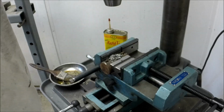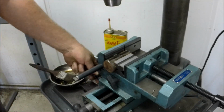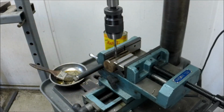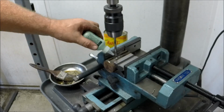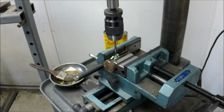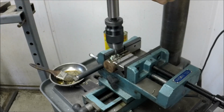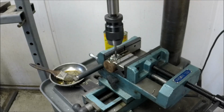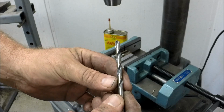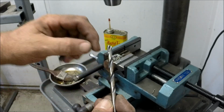Okay. Let's give the other one the same punishment. Just gonna back this up a little here. Take drill bit number 2. And we're going to do the same thing here. Just going to give it a little spot. Come in here and put a little bit of my, I finally cut a hole in my thing in my tip there. Ooh, well, I got a lot of that stuff on there. Okay, well, we'll give it the benefit of the doubt. A little smoky. Still clearing a chip. Still diving good. I don't feel anything binding up. Just diving down good. And there, she bound up there. That's what that looks like. And once again, I know that tip is very hot, but I don't see anything rolled over there. I'm letting you look right down this edge right here.